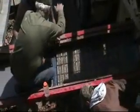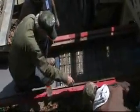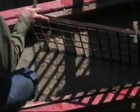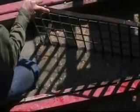This what we're fixing to take out of here is called concentrate. If you can see it on the film, if you look right down in here, this is absolutely full of black sand. Gemstone, it's got all kinds of stuff in it. And as we clean out, what we have to do is lift this up out of here and see what comes down here. What comes down here goes right through this clean out place right here and goes into a tub, or concentrates goes into a tub over here.